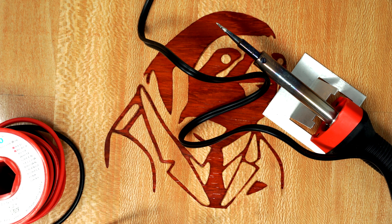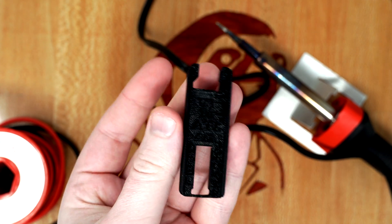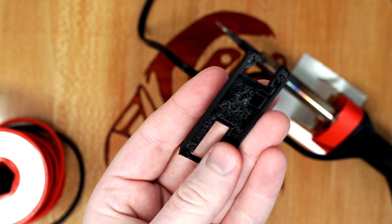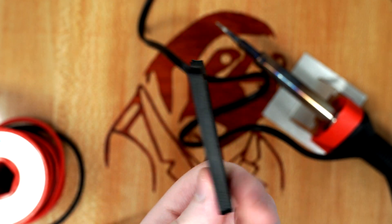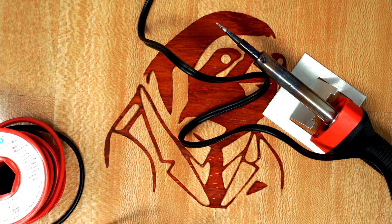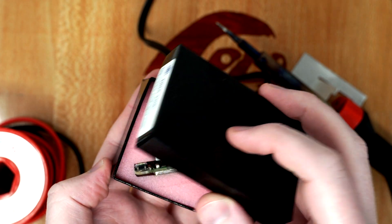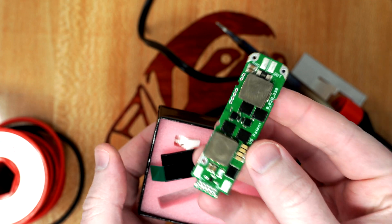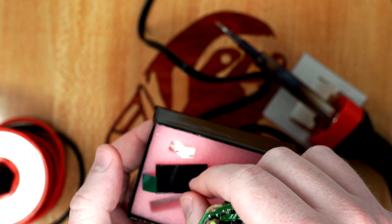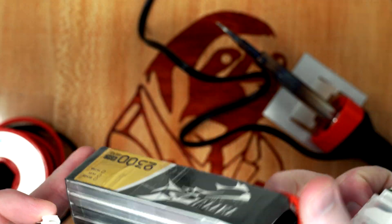I think the final thing that you need besides the chip itself is a 3D printed chip sled. This is what the DNA chip will sit on and be screwed into. This is not going to be used until the very end because you do not want to solder while this is attached on there because this will melt. And of course you need the chip itself — this is a DNA 250 color. Here's the screen, the chip itself, and the balancing little chip that goes in there for the battery section so that it can balance the cells.